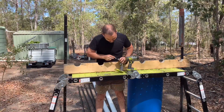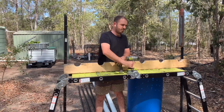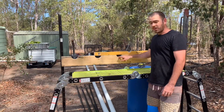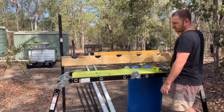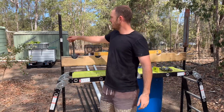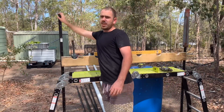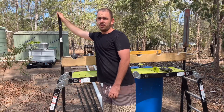A few more things not on the list that you'll probably need: an impact driver and some batten screws. If the posts aren't perfectly even, don't worry — I've left enough room at the top to knock the post in a bit more to get the right level. Another reason I used such tall star pickets is that if you get an insect or pest problem in the future, there are little caps you can get for the top and use the pickets as support for netting — just a bit of future-proofing.